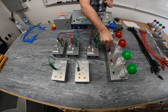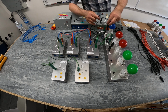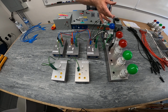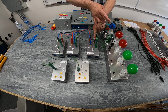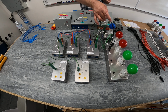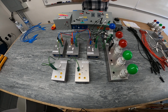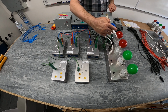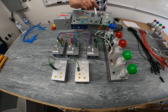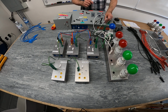So I'm going to go to the red light, parallel connect the first red light to the second red light, and basically this represents my switch leg to each one of my two red lights. The common of my three-way is a switch leg, and basically I'm feeding from here to both of my two red lights. Then the last part will be the identified conductor of each one of these two red lights. I've jumpered them together, which completes my parallel, but then I still have to connect the identified back to the power supply. And that's what that has done right there.